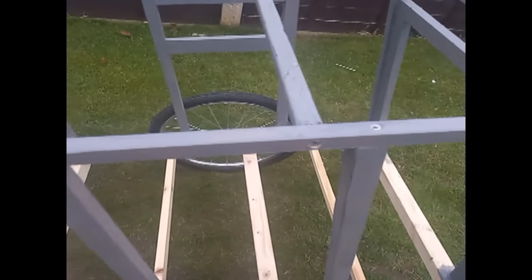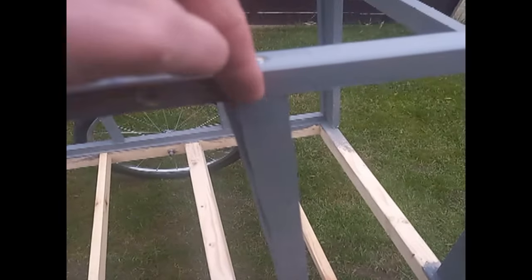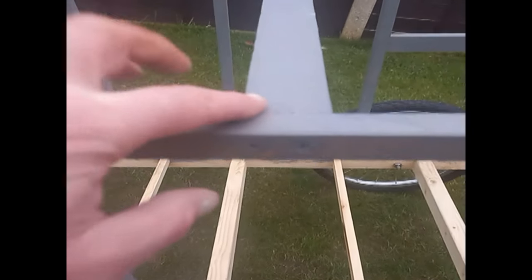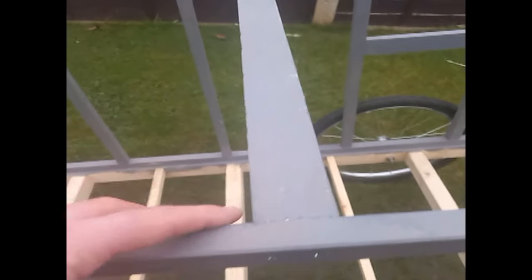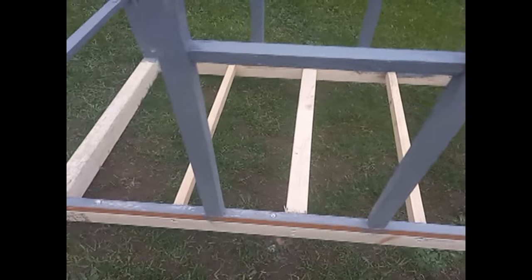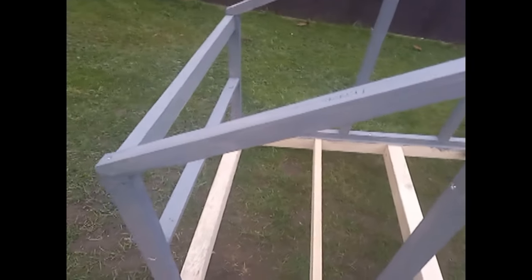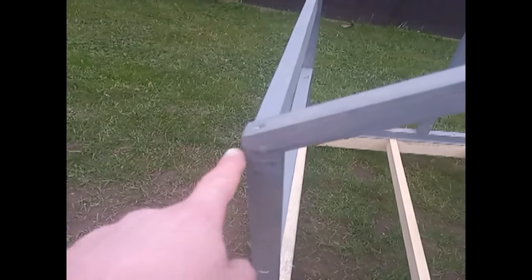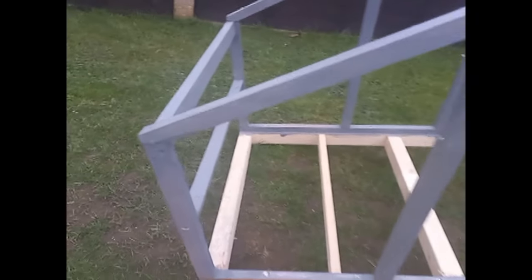To make this frame, what I've done is I've got loads of these little thin strips here and I've cut them all to the same length, and then I've put a blob of glue on top of them there, and then I've screwed in with 4-inch screws which go down to about that far there. Then basically I've gone round the same width tops, measured them all to the same width across, and I've put screws in them, as you can see. And I've done the same with the base. And then this one here, where it drops down at the front, I sort of guessed this. I just drew a pencil line there and cut it. And then I cut the end off there to make it flush.